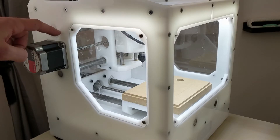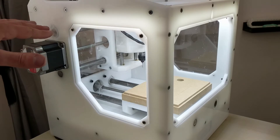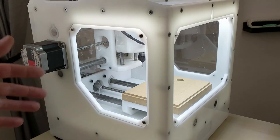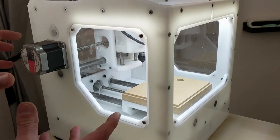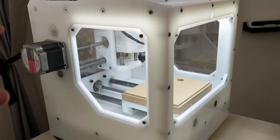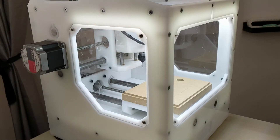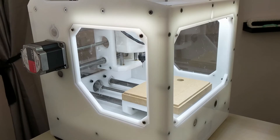The little cutouts here, as you can see, are taken from the other mill design. It just allows one of the rails to move so you don't over-constrain the axes. These are all riding on acetal or Delrin bushings, so even though all these holes were CNC drilled and then put together, there might be some differences during assembly that would cause the axes to bind. This lets the top rail float just a little bit and keeps everything from binding. It doesn't float enough to really influence cut quality, because by the time I put enough force on the cutting tool I'm going to bog my spindle anyway, so it works for this style of system.